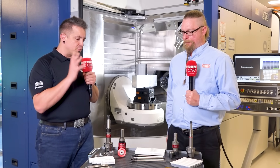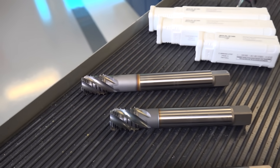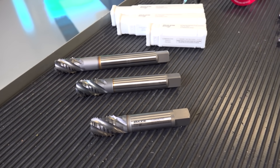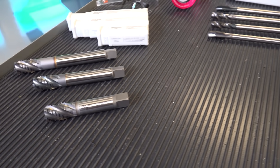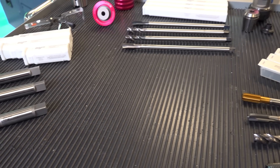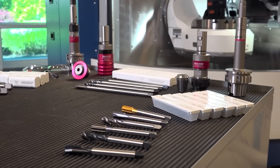For specifically the multi-tap line, what is your offering — do you offer cut taps, roll form? We offer all of the above. We offer cut taps in your typical spiral flute design for blind holes to pull the chips up out of the hole, and spiral point grinds to push the chips through the hole. We also offer cut taps with extended length for hard-to-reach situations — bottom of a cavity or around a side wall — and we also have them in the cold forming tap design.